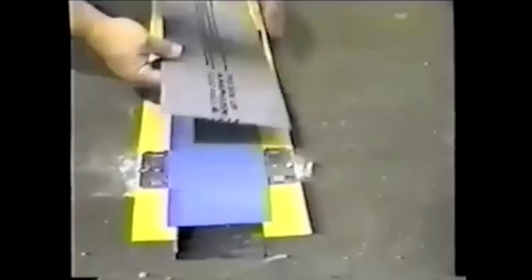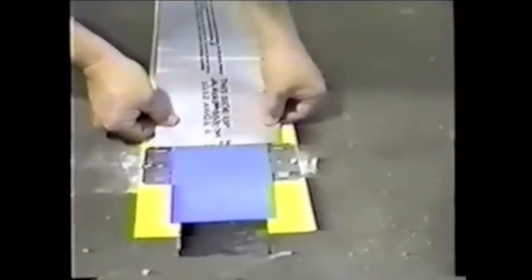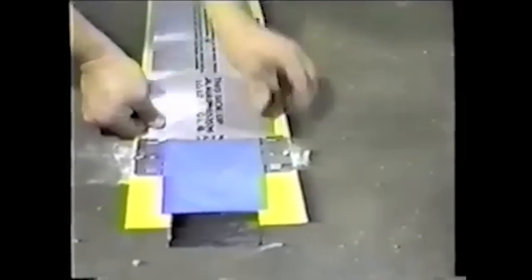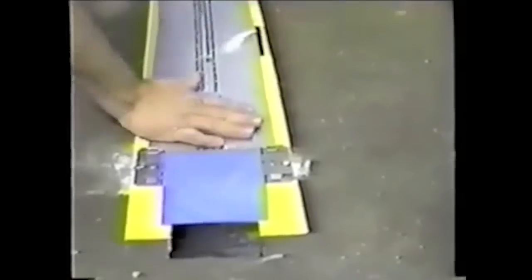When terminating the top shield to a floor fitting base plate, cut the top shield at the top shield cutting indicator marks on the base plate. Insert and slide the top shield between both stainless steel bonding clips mounted on the base plate for secure termination.